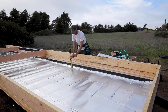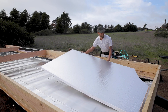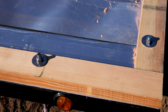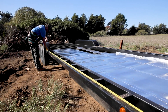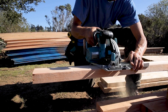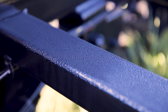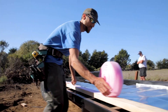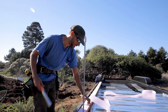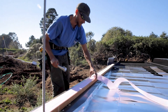First I glued some expanded polystyrene insulation over the top of the flashing — this will be covered in more detail in episode 5, but it was much easier to install now before the subfloor framing goes on. To install the sill plates, I measured the front length of the trailer up to the fender, cut a 2x4 to fit, and placed it on the trailer just above the holes I drilled for the anchor bolts. You can notice there's a lot of condensation in the mornings, and we want to keep moisture away from the wood, so I'm tacking a piece of foam onto the bottom to protect the wood from that moisture.